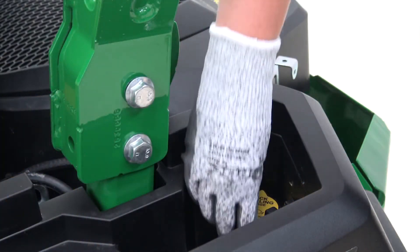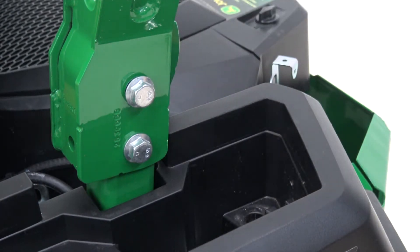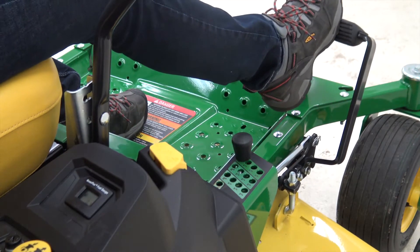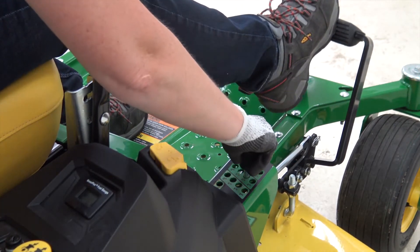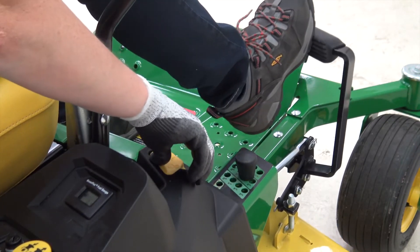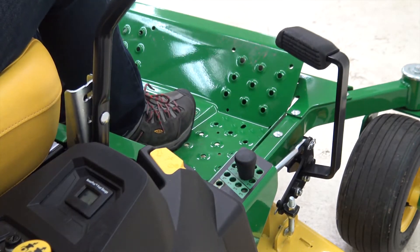The quick leveling method measures at three points of the mower deck using the deck leveling gauge. To begin, insert the magnetic pin at the 2½ inch hole and lower the deck. Once the deck is adjusted at the 2½ inch cutting height position, it is level and calibrated for all other cut height positions.